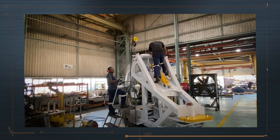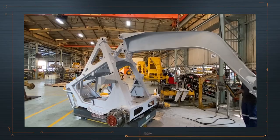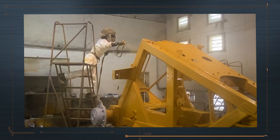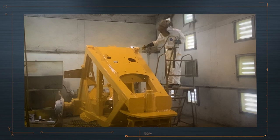This is the pre-paint assembly process where the hydraulic wheel drives, boom, cylinders and tail wheel are bolted onto the frame. A semi-assembled rolling chassis is now ready to go to the paint shop. The machine is now ready for painting and a top coat is applied. Bell uses two colors: a yellow and a grey. By working in this way it becomes easier to order paint and only two spray guns are needed to do the job. The more colors that are needed, the more complexity there is in the paint shop.